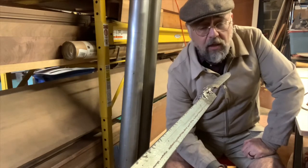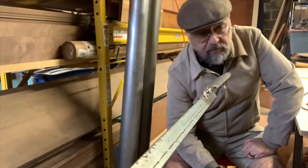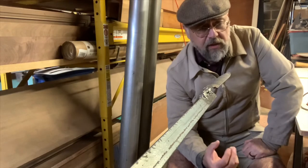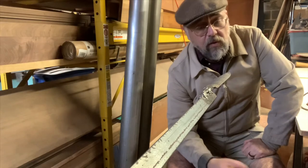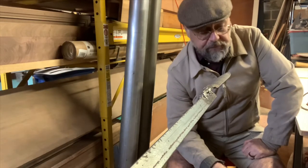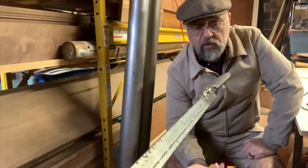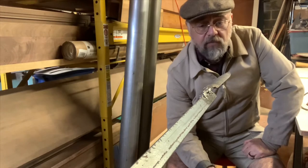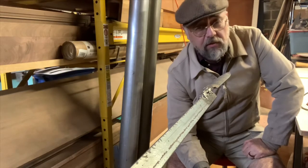Not that it bothers us now, but if ever those front pipes will have to go onto a mandrel for whatever reason, any droplets on the inside or any additional pieces on the inside could create a problem for a future technician or organ builder to work on those pipes. And we don't want to upset folks. We don't want to make work unnecessarily difficult for the next generation.